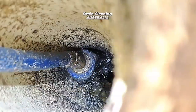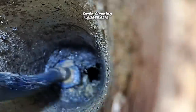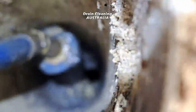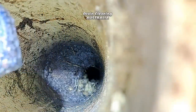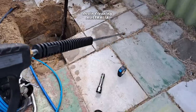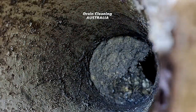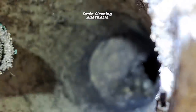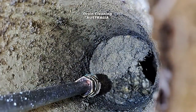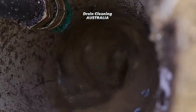Are we gonna clear it with the old plunger? Look at that — we're just getting in amongst it now. Over time it's a very common issue: these PVC junctions will snap from all the weight if the sand hasn't been compacted around them when installed, and the roots grow in. Mr. German Jet has been substituted and we've got Mr. Gun. I'll try and get you as close to the action as possible — give it a quick blast. Whoa, look at that! You little ripper!